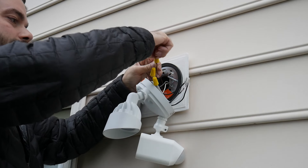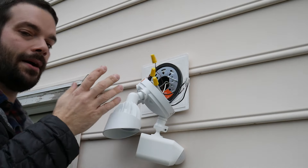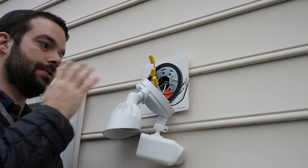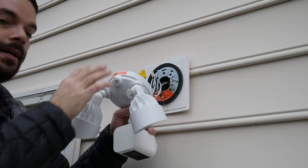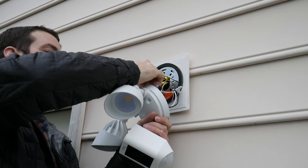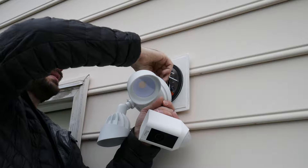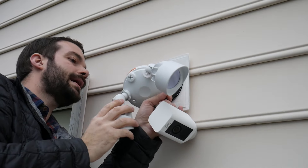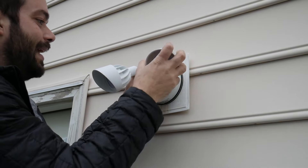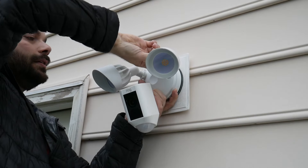Pretty simple so far — not too bad, easy installation. Don't be too worried about it; just like any other electrical appliance, most have the same white, black, and ground cable setup. On to the next step: take all these wires and tuck the house wires back into the electrical box. That'll help the unit sit more flush against the house. Don't force too many in too hard — you don't want the caps to come off or any wires touching.